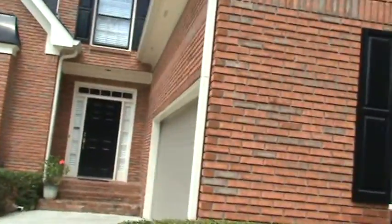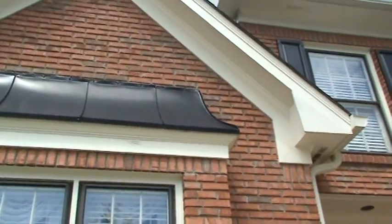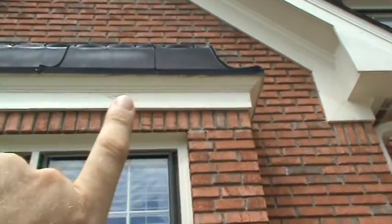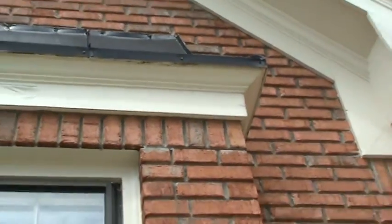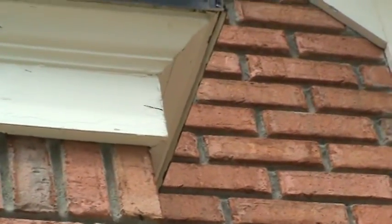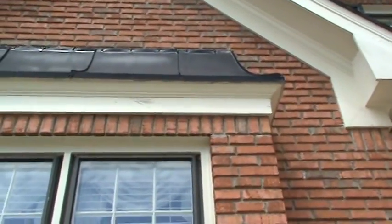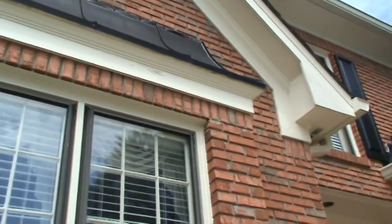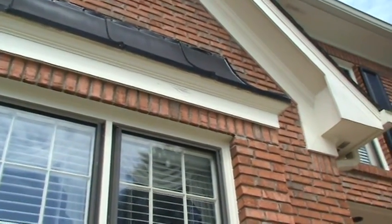All the way around the house you're going to find all kinds of rot. For those of you with little metal mansard roofs over your bay windows — they're great, keep them painted — but the paint is shedding here. They thought it was rot, but it's actually water getting behind. The crown molding underneath has rotted because the bottom edge of this mansard roof has a gap. It was never caulked or sealed. You can see the split in the fascia where it's starting to rot. Capillary action sucks a little water back every time it rains, coming up underneath and rotting out that crown.